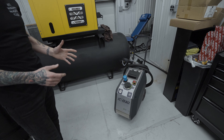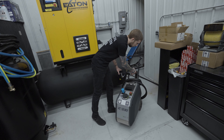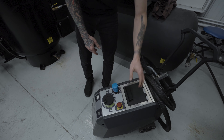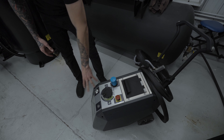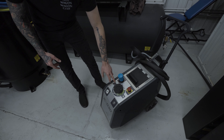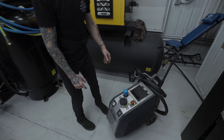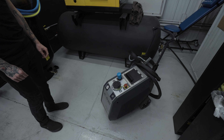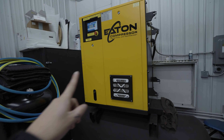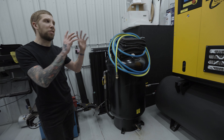Here's the machine — it's an ICS 030 Evo 2. It's a pretty precise gun setup, not a big industrial gun, so you can do more precision work with it. You load the ice in the top using 3-millimeter rice pellets, and it's got a feeder that feeds it to the gun and mixes the air with it. You can control everything — the consumption, which controls what size dry ice goes through the gun, from small pieces to full pellets. You can also control the pressure — up to 120 PSI, which will actually take paint off.